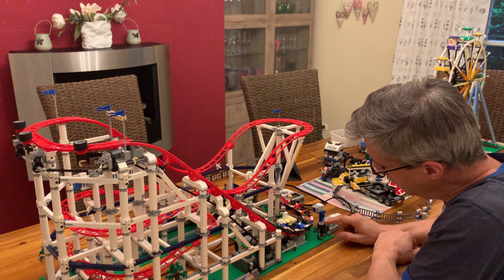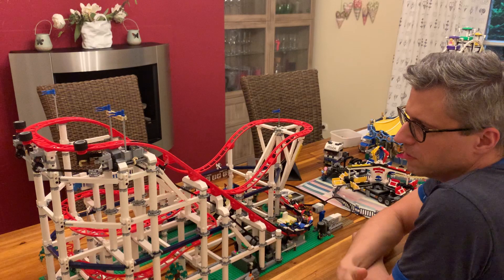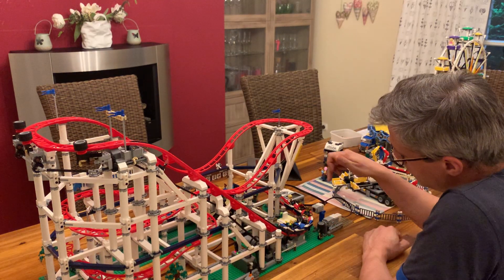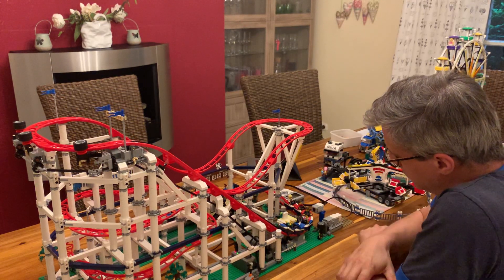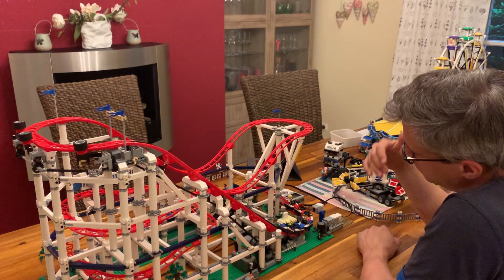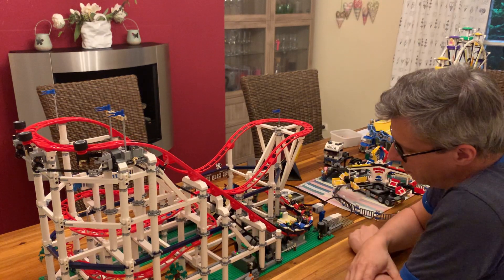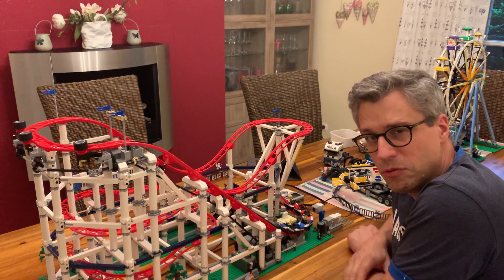To overcome this problem, we have built a small wheel here. It's similar to the wheels in the top curve to make the sledges go around the top curve. We have attached this wheel to a LEGO Mindstorms motor, which is also attached to a sensor and to the main EV3 module. The sensor detects the sledge in that area, the computer makes sure that the distance to the preceding sledge is kept, and then the wheel pushes the sledge onto the main chain. I'm going to show you how this works now.